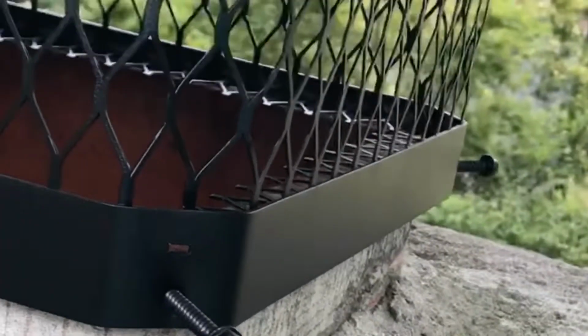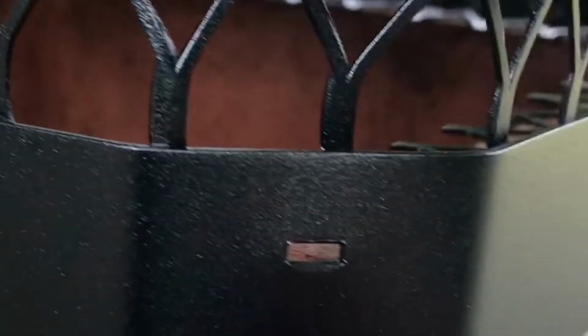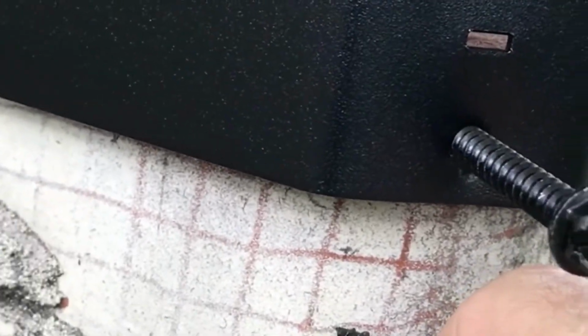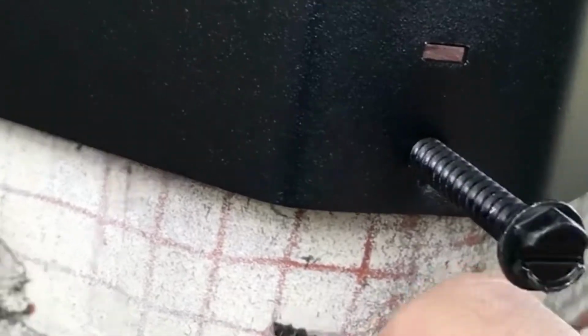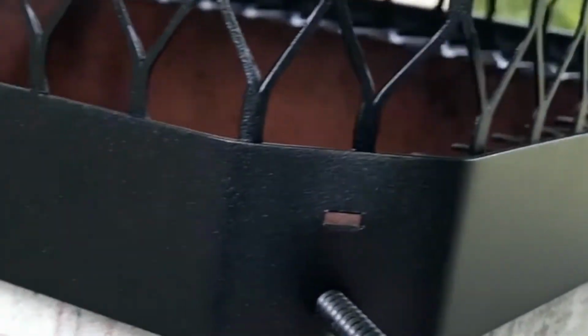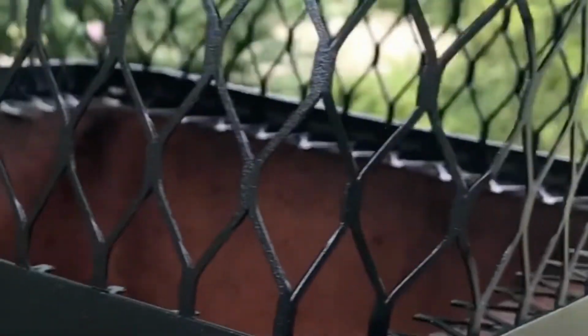So this is on. Now, I have seen where customers, and I'll show you here, sometimes they'll bring up a battery drill, and they'll have a masonry bit, and wherever the screw made an indent or they make a mark, they'll drill slightly into the clay flue tile, just a little divot to get better bite for the end of the screw. But once again, this clay flue tile, and I've cut my fair share of this with diamond blades, it is a pain. So that's for someone that has the time and inclination to get up here and do that. And I have only seen that maybe two or three times in the last 20 years. So this is generally the preferred and the easiest method to do the installation on these when you have a clay flue tile that extends above the masonry crown.